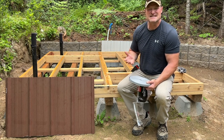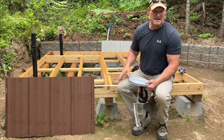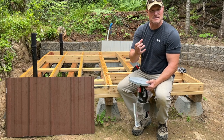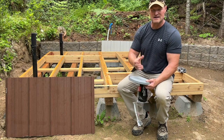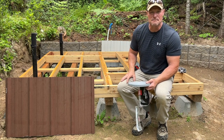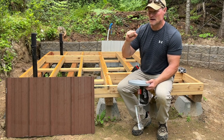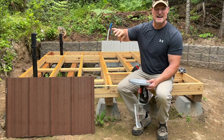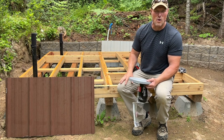So I think because I had that insulation, I might as well insulate this floor. It'll make a difference in the winter time. And then my PEX coming into the cabin, I'll get some of that foam pipe insulation and just wrap that PEX from ground level up to where it's gonna meet my pump and convert down into my on-demand 12 volt Seaflow pump, and then insulate where it's gonna go into my instant hot water tankless water heater as well.